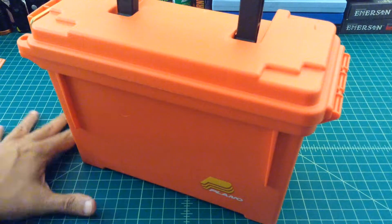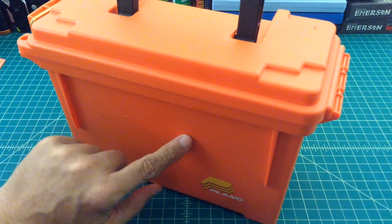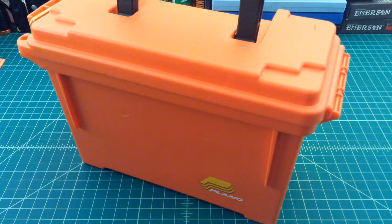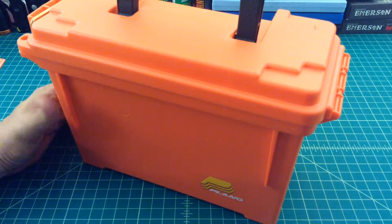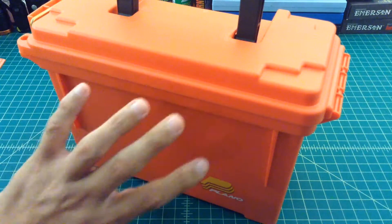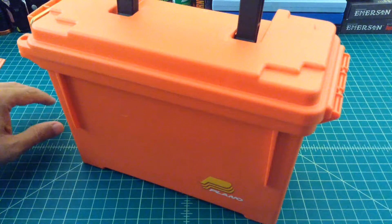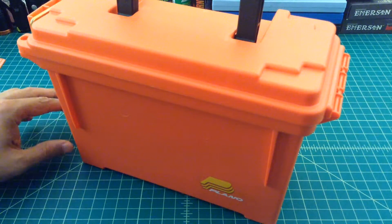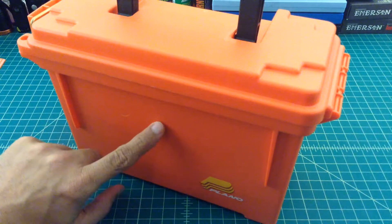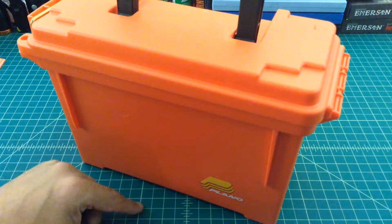This project is a second one I'm building — it's going to be a solar generator. It's going to have a solar panel connected to it, and it's going to have a 4.5 amp hour lead sealed battery inside. Now a lot of people say 4.5 amp hours isn't a lot, but this is a small, tight-fitting box, and the important thing is that it's 12 volts. You can get a lithium ion battery with higher amp hours, but it can't deliver at 12 volts. For us, 12 volts is important because I want to be able to run small ham radios or CBs off this box, powered by solar panels.